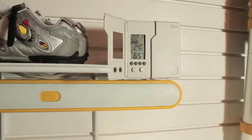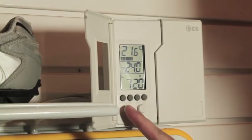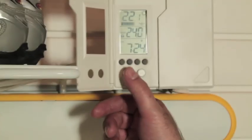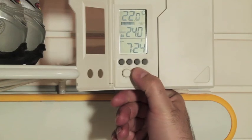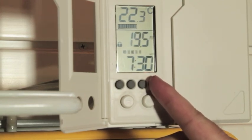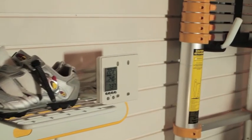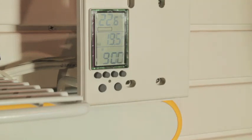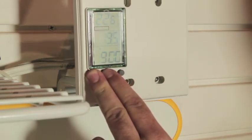Next we will talk about setting the high limit function. This will prevent anyone from raising the temperature higher than the temperature that you select. First, set your temperature to your desired limit. Then press the usage time and the set buttons for three seconds. A lock symbol will now appear on screen. The down arrow button can still reduce the temperature, but the up arrow button will only bring the temperature as high as the set limit — here set to 24. Note that this high limit function will affect the programs as well; if previously set to a higher temperature, they will be reduced to the new high limit. To turn off this function, remove the faceplate to access the reset button and press it with the tip of a pen or pencil. This causes a partial reset, turning the clock back to 9am Monday and causing the lock symbol to flash. Then press the usage time and set buttons for three seconds — the lock symbol will disappear and the high limit function will be turned off.